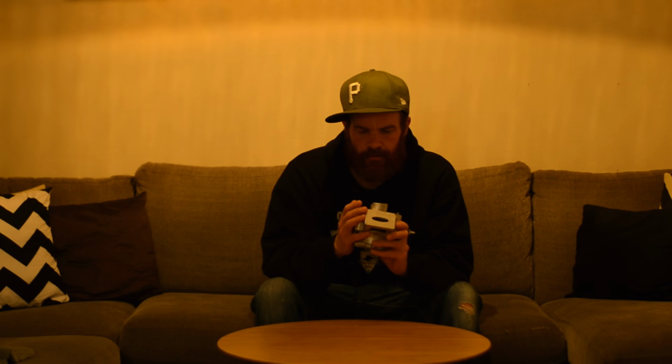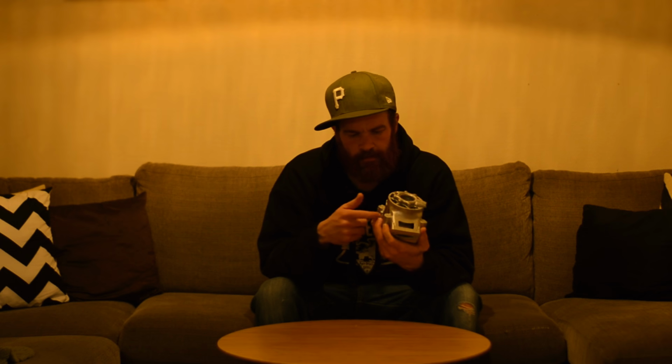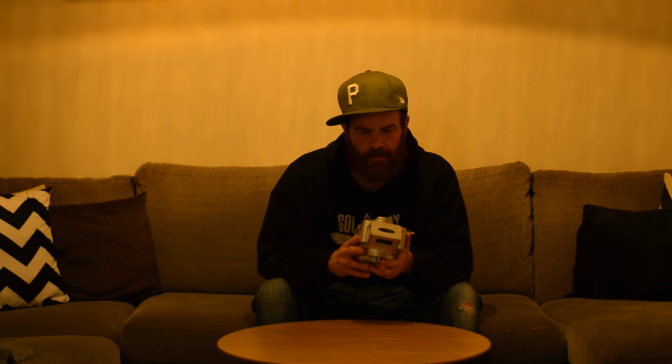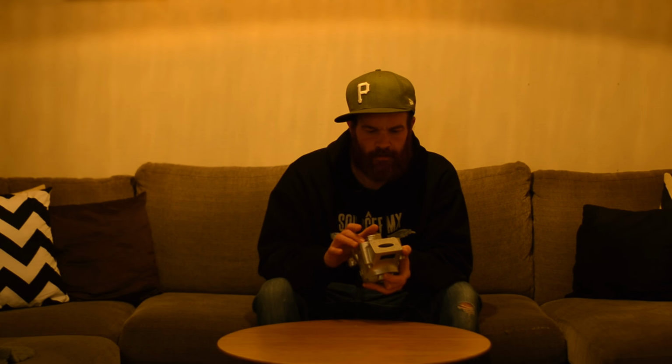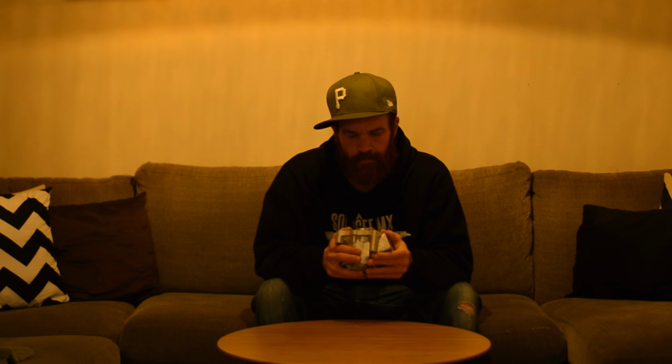Now, this casting, I vibrated the mold, and that actually seemed to produce more bubbles. I've chipped away quite a few bubbles here. Also, taking the mold to 400 degrees Celsius dries out all the water and evaporates the PLA completely, but it also makes it really prone to cracking. I did not have the issue with the broken pieces of the mold when I just brought it to 300 degrees Celsius. So maybe a middle ground, 350, is better. I'll try that next time.